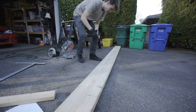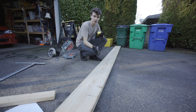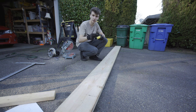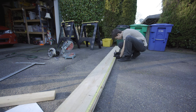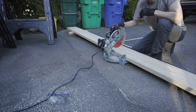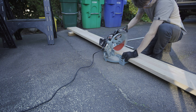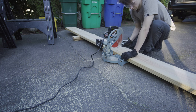Now that I have the bottom and top of this frame cut, I'm going to measure out and cut the support beams. There's going to be four: one on the left, one on the right, one in the middle, and one on the back. The left, middle, and right ones are cut at 70 and a half inches — that extra inch and a half will leave room for the back support. I'm going to try the compound saw, and by flipping the board it should be pretty easy to get this cut using two cuts, one on each side. It seems to work really well for cutting a two-by-ten even with the blade not being quite big enough.